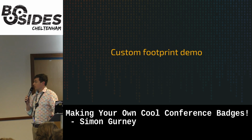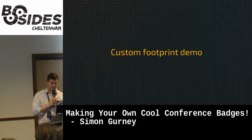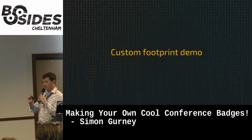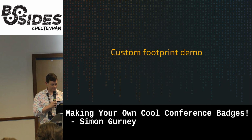The alternative is to build your own footprints, which I was a bit averse to at the start, but actually once you get into it, it's dead easy. And I find it better because my soldering is pretty rubbish, so sometimes I make the pads slightly bigger, so they're a bit more forgiving. I'm going to do a quick demo on that because I think I've got time.